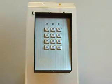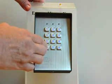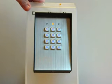This is the KPX100 setup for multi-user mode, following instructions from the KPX100 quick start guide. The KPX100 comes from the factory set in single user mode. To enter the factory set master code, press 0000 star. You are now in program mode.